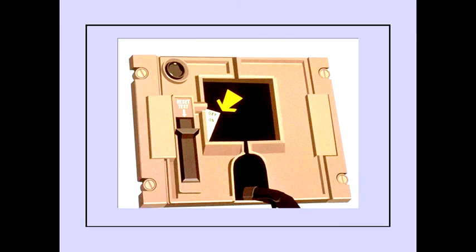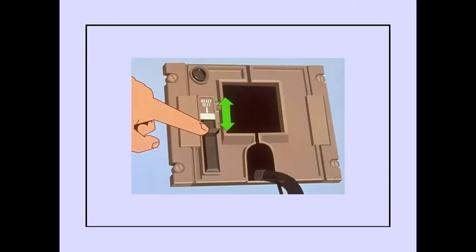The stowage box doors can be closed without shutting off oxygen. The oxygen on flag indicates that oxygen is still on. With the left door closed, pushing and releasing the reset test slide lever resets the valve and shuts off the oxygen. The oxygen on flag disappears.